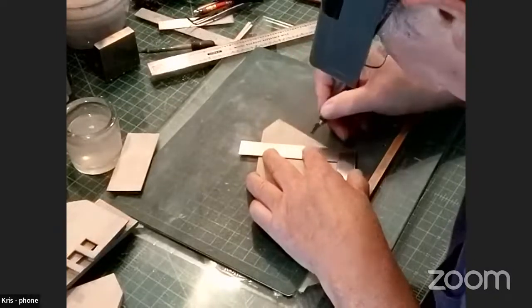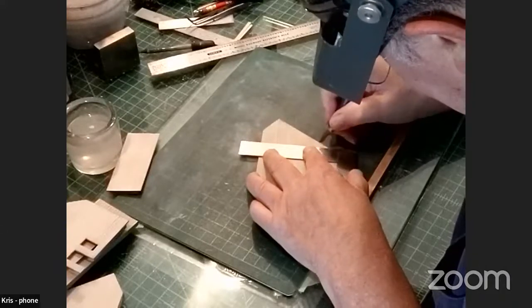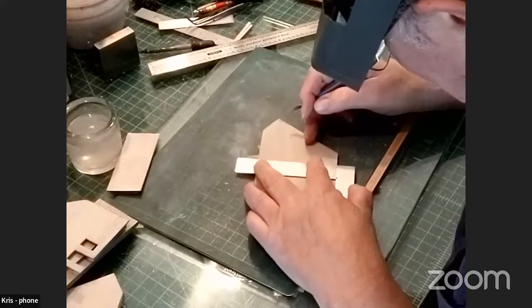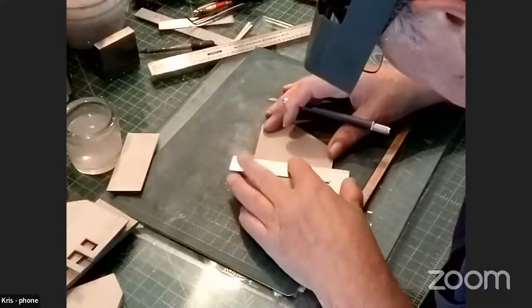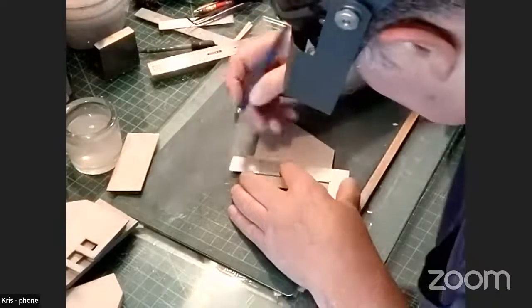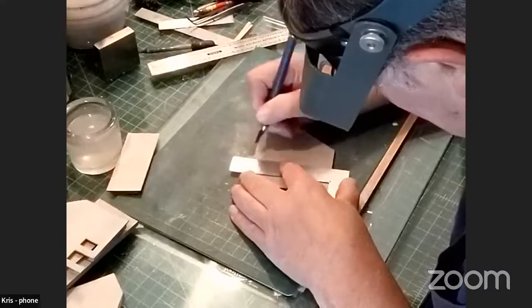Yes, cut it away. Okay. What you're asking is, do you get rid of that gap? Yeah, and put your batten down. Yeah, I always trim the batten down as well. If it's a tiny window, you can just drop it in place and then mark the edge, and then come back and chisel out that little edge so you get a nice flush fit. Yeah, it lays flat then.